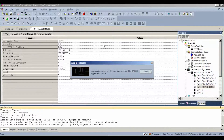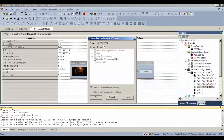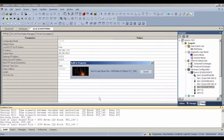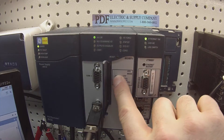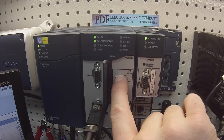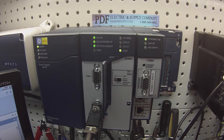Part of this test is testing the switch — I'm going to open this up so you can see. Like the CPU, it even says 'CPU mode' here. We have stop, run with outputs disabled, and run with IO enabled. We're going to continue with the download, and once it's done downloading we'll exercise the switch to get it into run mode. Now we bring the switch over one — we're in run mode but with the outputs disabled. One more to the right, now we're in the furthest right position: the outputs are enabled and we are in run mode. That's what you want to see.